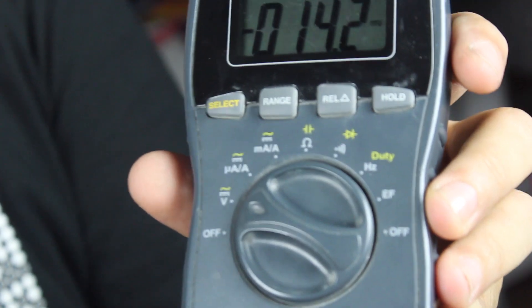Now that is initially set for DC voltage — that's direct current. In your house and a couple other circuits it's AC current, and in order to switch that on this multimeter I just hit select. Now I can measure the wall outlet, which is something you need to be aware of because you need to be safe. These leads are non-conductive on the back, so I can plug them in the wall and confirm that I have 120 or 115 range alternating current, but there are some circuits where I need 220 or 440 that I can check with this as well.